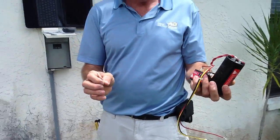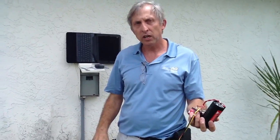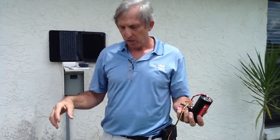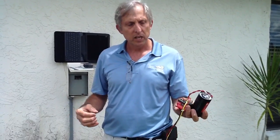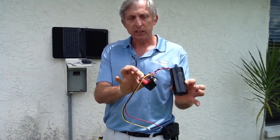The advantages are: your compressor might start and stop as many as 10,000 times in a year. The compressor burns about 4,500 watts of energy every time it's on, and every time it comes on, it takes about two, six, maybe ten times the amount of current to start as it does to run it. A lot of times these compressors, after several years of starting and stopping, get weak — so they need a supplemental power booster.